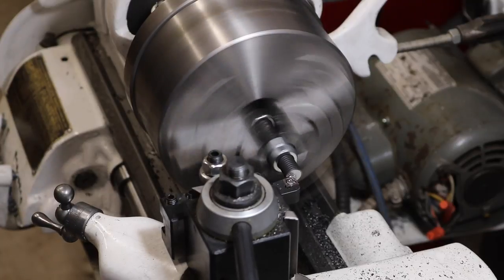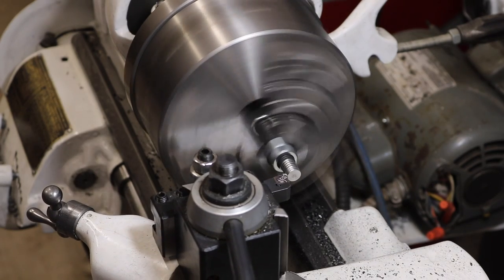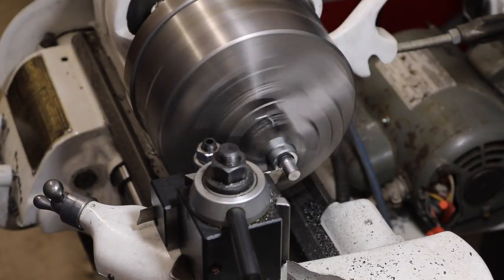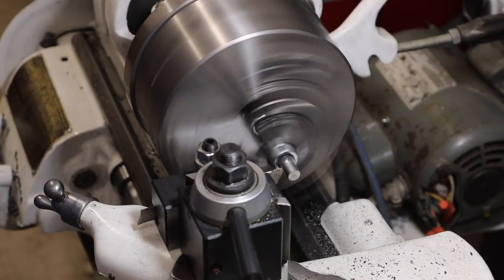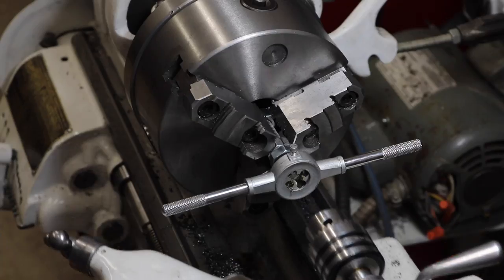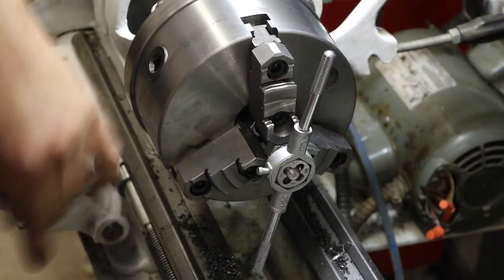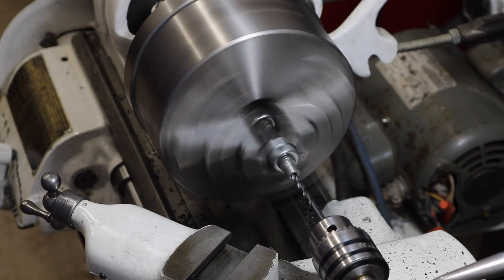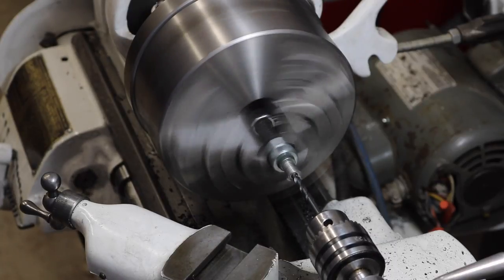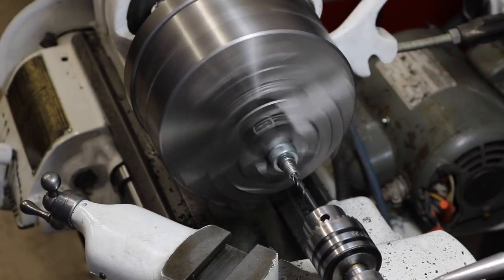This all-thread is half inch in diameter and we're going to turn a portion down to 3/8 inch diameter to fit in the threaded hole we just put in the reducer coupling. I totally stole this spring trick from Cactus Workshop — go check him out on YouTube. I'm adding threads to this — this is the hole that the MIG tip is going to screw into and become the propane orifice.